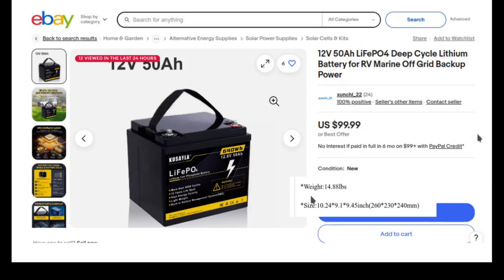Ken Napolitano, when he rewired my boat, put in AGM wheelchair batteries — he was already ahead of the curve even then. When those batteries went bad, I replaced them with lithium. With the old AGM wheelchair batteries, they didn't last a year. But these lithiums could go 10 years — lithium will have 3,000 to 5,000 cycles on them before they give out.